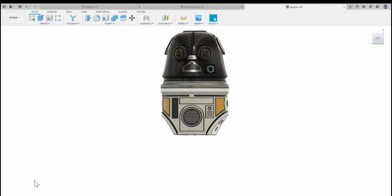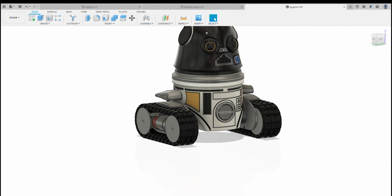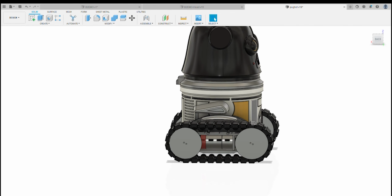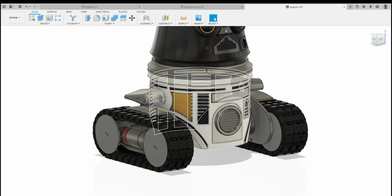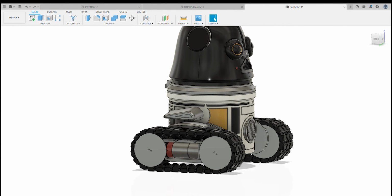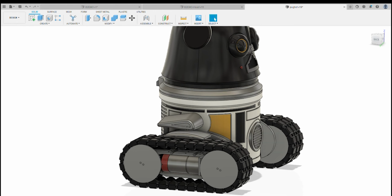And then effectively that's your body and there's your drives. One of the features is that there's a servo there that will allow it to tip forward and backwards. The easiest way of doing that, to be honest, is to add a mixing channel to your controller and run that bottom servo on one of the dials on the FS-i6X controller. What you effectively do is run a mix for the forward and backward sticks, and when it goes forward, a very low percentage, 10% or something like that, it will slightly move that servo one way, or slightly move the tilt of the body servo the other way, which means you're not having to tilt the body manually when you move it around.